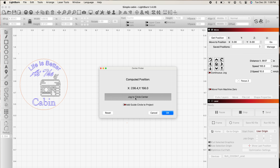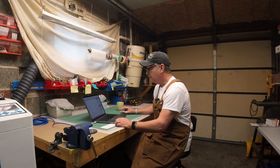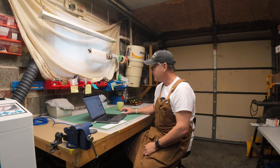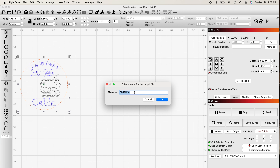I've completed my circle finder. I jog to the center and click OK. I'm going to take my cursor and grab a little bit of everything from the bottom right up. I'm going to go up to the top middle and group that object. I want to make sure my origin is set to the middle — if you go across to the bottom right, you'll see I've set the origin to the middle. That will match the center finder because the laser has now moved itself to the center of my slate coaster. I can now send this file — I'll call it 'sim slate,' click OK.